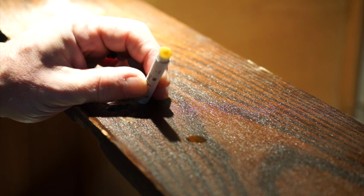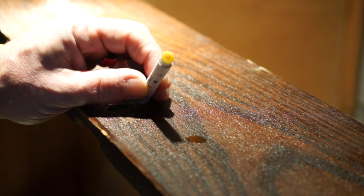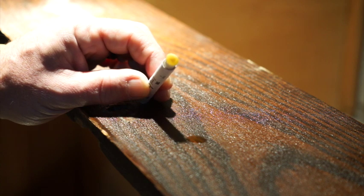And you can see here I did my lead-based paint test. It did test negative. And again, when I sand and work on something, I don't want to put myself in danger, my family, or my pet, or any guest pets. So I do the lead-based paint tests every time, unless I know that it's just a latex paint or bare wood or whatever.